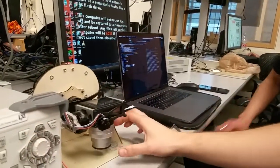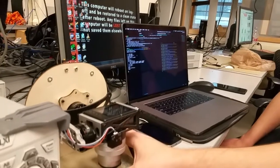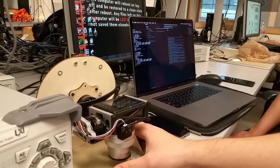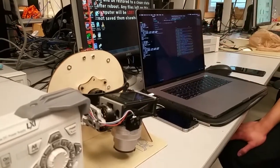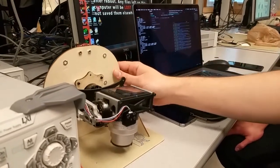After you power it up, first the microstick boots up and there's a log of everything that's happening. Then it initializes the IMUs — it does two seconds of gyroscope calibration to calibrate out the drift and bias in the gyroscopes. Then it turns everything on and goes to point straight down.